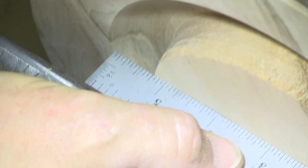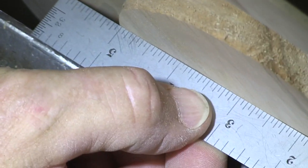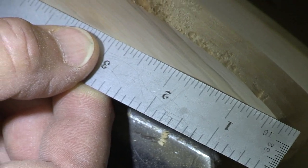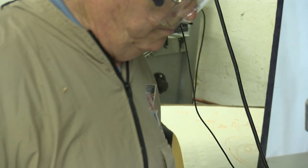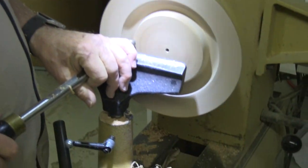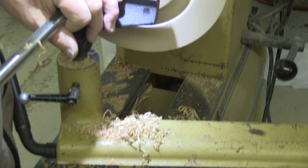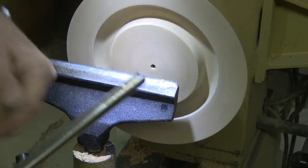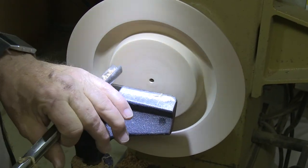but it's not terrible. And the other thing is, if you're like me, you'll find that the center is more likely to be domed than divoted, you know. That's good, because if it's domed, you can sand it off. If it's divoted, you're screwed. So, better a dome, and I think it's because as you go across and you go at the same speed, it's rotating slower. It tends to push the tool out, so it ends up domed. I think that's a natural thing.